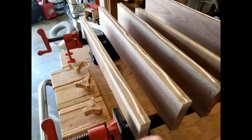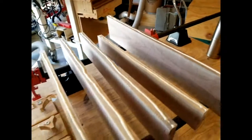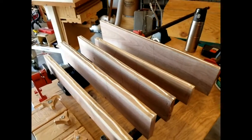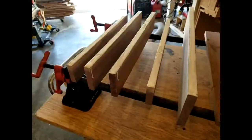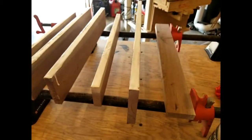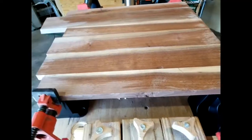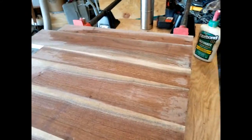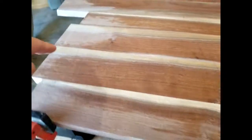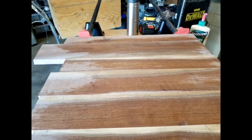It's not a hot day so I've got plenty of time. I've turned them all on edge — they all lay down flat that way. I'll spread the glue and then clamp them up. I do have a wet rag to wipe off any drips. I've spread the glue and I'm going to turn them over now — the inboard piece doesn't get glue on it because they all rotate to it. I just gently apply enough pressure to keep them lined up; the glue squeezed out on top. Then I take my wet rag and wipe over it — the glue lines are pretty well lined up.